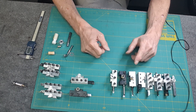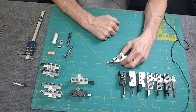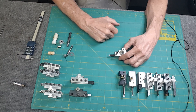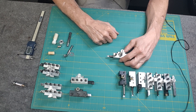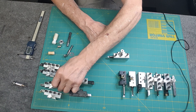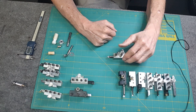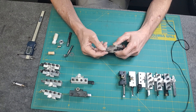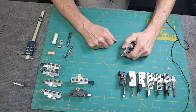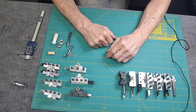This D-bit I just made mounts this way so I can do chamfering inside of a hole because it's rounded, and I can also do outside chamfering. Mainly I made it because a lot of times I need to chamfer the inside of a hole and you can't do it with a standard tool — it hits. I've got to make a nice lapping or honing disc so I can hold it solid, because trying to do it by hand means you move and you don't get a perfect edge.